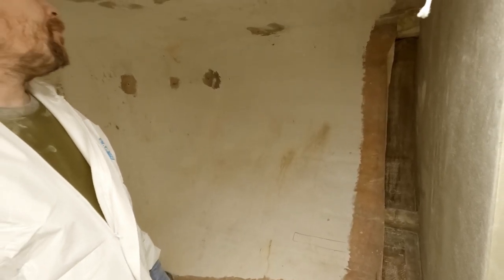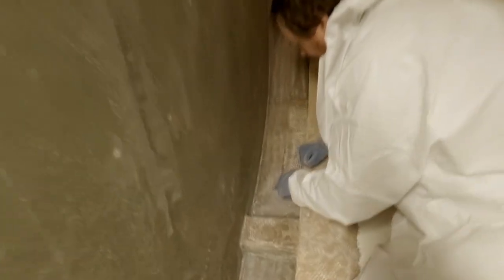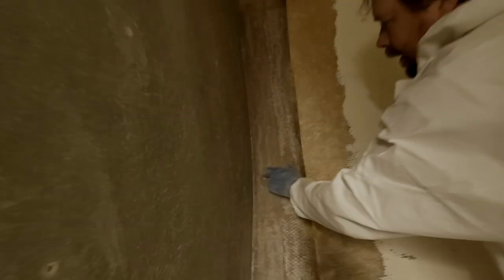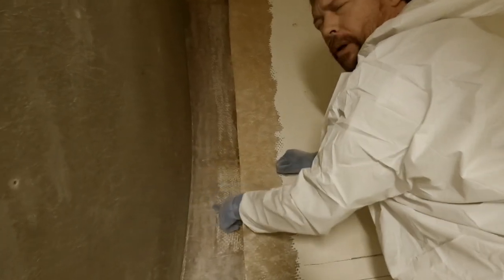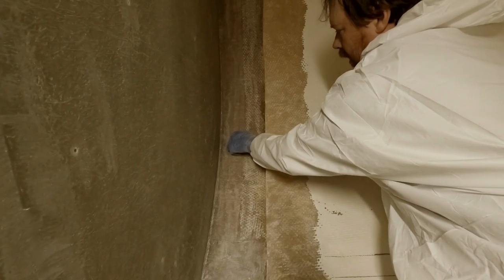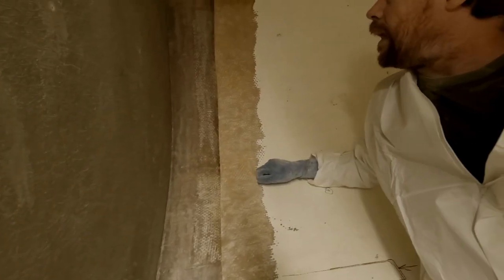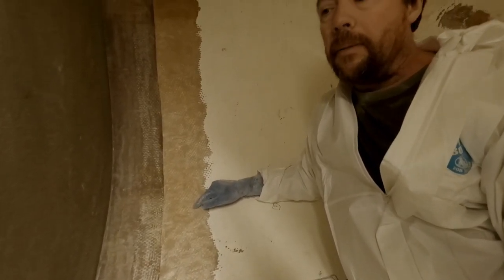You can see I hit that with a 24 grit, a fresh sanding disc, and you can see how it really keyed that up good. I'm confident we'll get a good bond here. This is the original layer that we put down before our bulkhead went in. I think we put, what, two layers of mat right here? Yeah, and you can see that those tied in really good to the hull, so we shouldn't have any problems with delamination. It's all in prep.